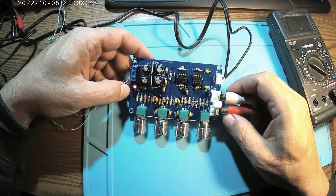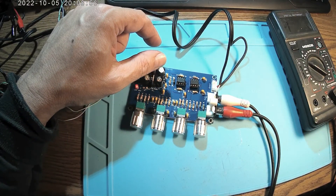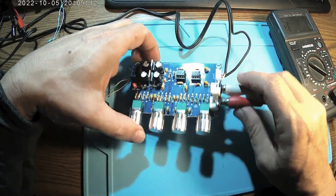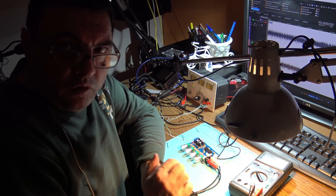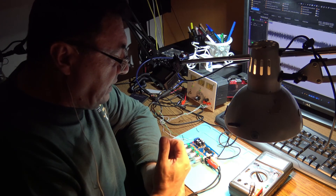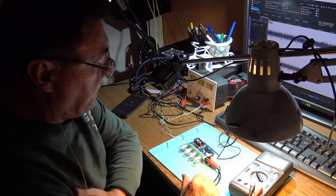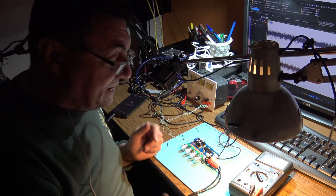So that's it for today. The schematic is working, the PCB is okay, everything is fine. Even with these kinds of circuits — let's call them fake circuits — they are not even warm, because they're probably only taking a few milliamps. Don't forget about grounding the potentiometers. I'm going to inject some waveforms and we'll see how things are running, and I'll also check the self-noise of these circuits. I hope it is useful. Please like, please subscribe, and have some fun. See you, bye-bye.